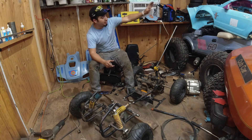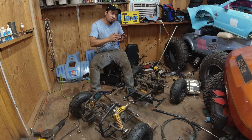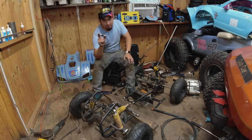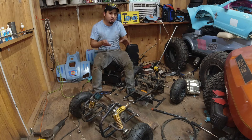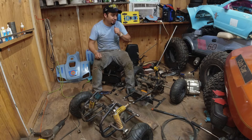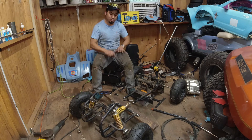For the tires to be right under the body, centered on each side, I have to make the frame only two and a half inches longer. So I'm just gonna weld it right there so I can put it all flat. Actually, I'm just gonna tack it a little so I can break it if for some reason it's not right. Then we're gonna put the body back and see if we got it right. After that I think it's gonna be pretty simple.